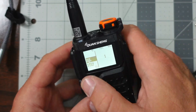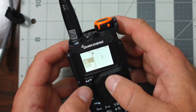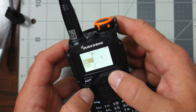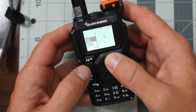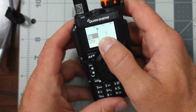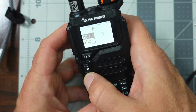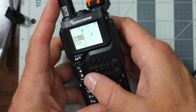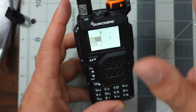In my settings, by hitting M, I get into my settings menu and my squelch is set to one. If yours isn't set to one — for example if it's set to three, four, or five — once squelch is selected you're going to hit the M button. That brings you one down in the menu, and then you just click down until you see one. If we leave the squelch open, this will be constantly receiving and will never have the ability to transmit APRS. So we leave it at one.